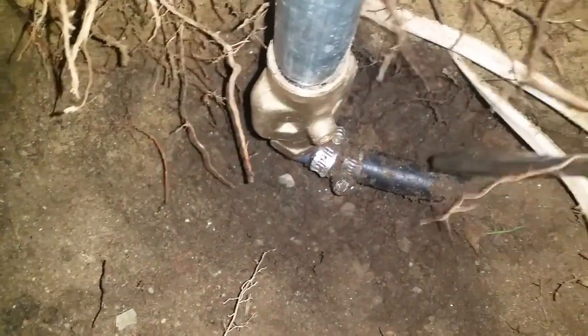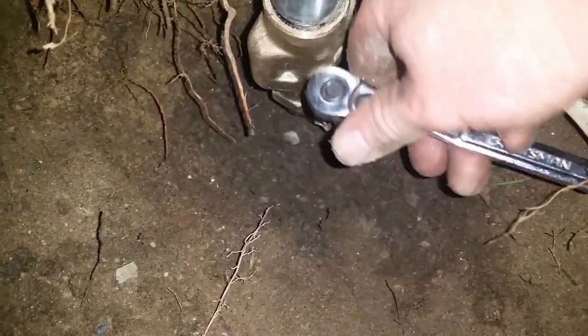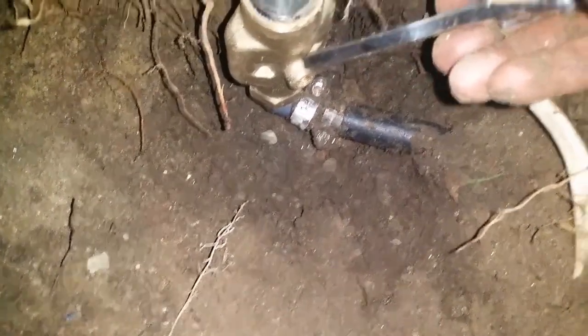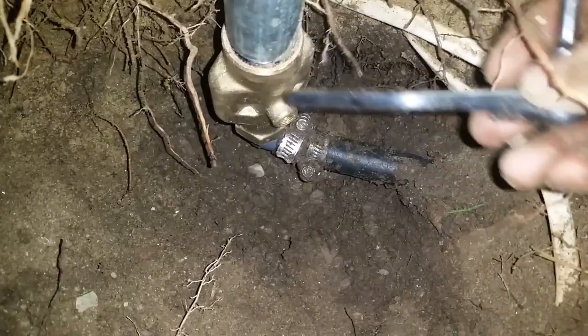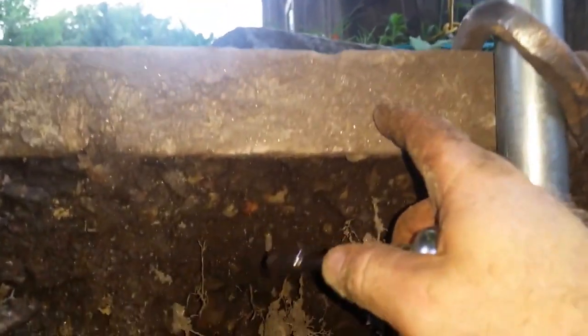Back in the hole — this one went on a little bit easier than the other one came off, which is great. I tighten the hose clamps by screwdriver first, then use a 5/16 socket with a ratchet to get a little more out of them — I really don't want this to leak. I also dug out a bit around the drain at the bottom. If I fill this space with gravel there's quite a bit of room, and it doesn't all have to be below the drain outlet.